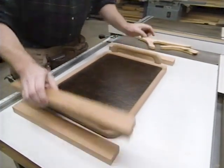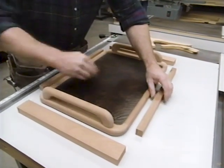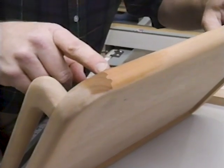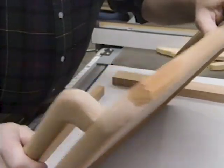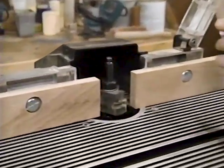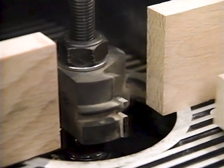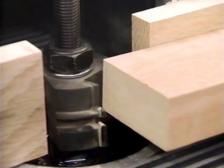Let's get started building the tray. Here are the four pieces for the frame — two wider pieces for the ends, and narrower pieces for the front and back. I'm going to join the pieces at the corner with what's known as a glue joint. Its shape allows a lot of glue surface area, and when you have a piece like the front and back which is end grain, it makes a much stronger joint. I mill that joint using my router shaper table, which I've equipped with a shaper bit that has three cutters in the profile of that glue joint. I've taken the time to adjust the height of the cutter so that it's perfectly centered on the thickness of my wood, and I've adjusted the rip fence so that it just nips the edge of it.